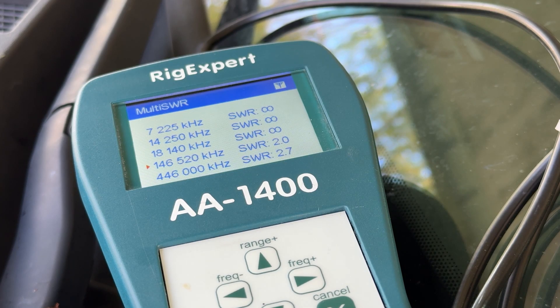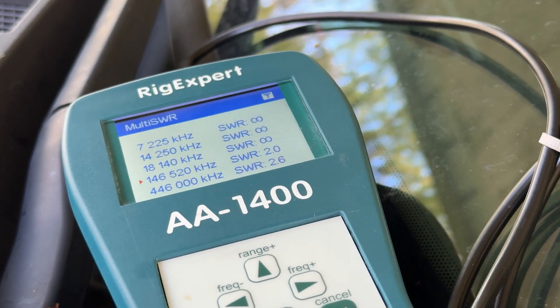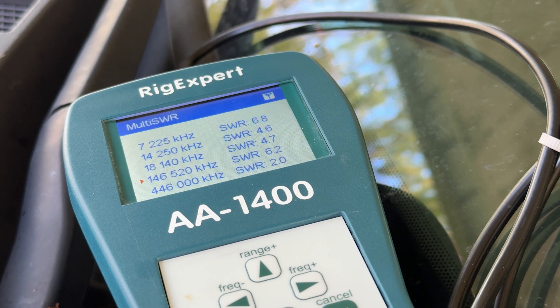I've got the camera aimed at the meter well enough that you should be able to read it on screen. I'm going to loosen up these two adjustment screws and see if we can better those numbers. You can see that as I touch the antenna, it's also changing the SWR. So this is one of those things where you're going to make small adjustments and see what you get. I raised it up maybe a quarter of an inch, tightened it back down, and got my hand away from it. Now we've got 2.0 on two meters and 2.5 on 70 cm, so I don't think that's necessarily better. Let me drop it back down a little bit.